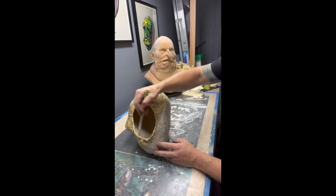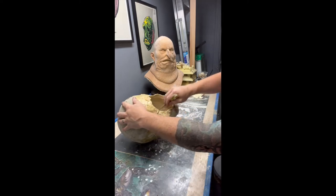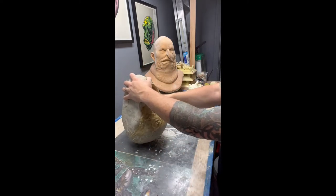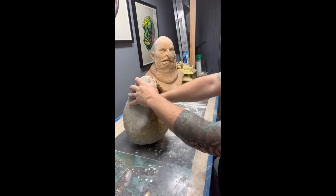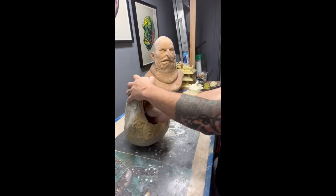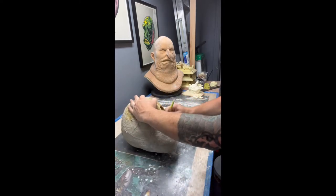Make sure that I get a little bit of a layer of baby powder built up around the entire inside of the latex mask. The reason for this is it will make sure that it doesn't stick — once latex dries, if you pull it out, an earlobe or something can stick to itself. So this ensures that the mask will not stick to itself. Just brushing some baby powder around, making sure I've got a little layer everywhere.